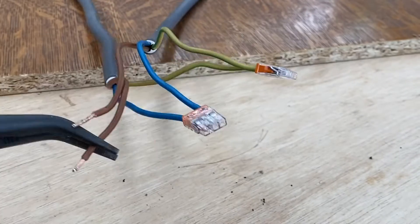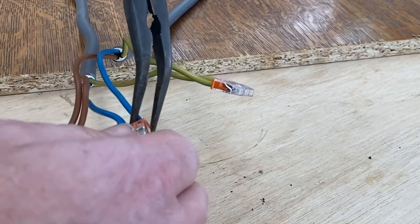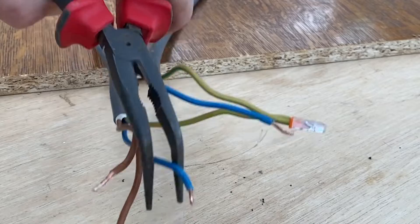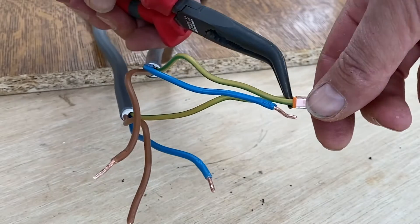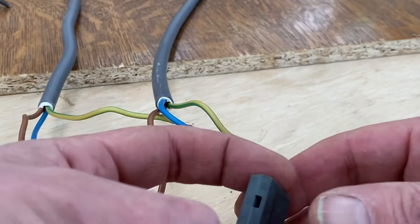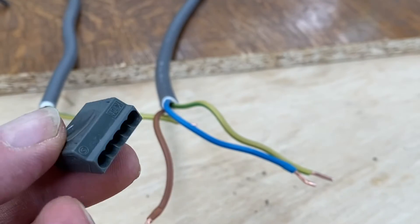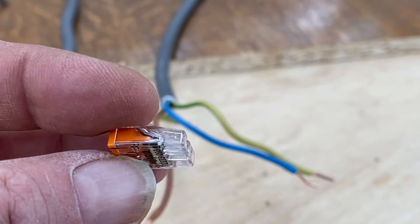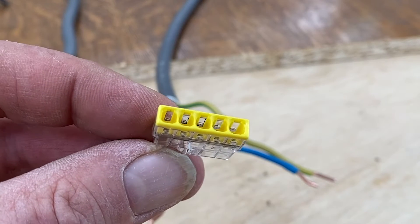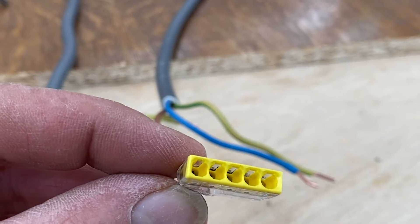So when you're inside plugs, it's really difficult to work with. These are really connectors you put in once and then forget. These connectors may also look like this — same principle — but the reservation is that you can't see what's happening inside, that's why I prefer the transparent ones. And sometimes you need a lot of connections, specifically when you have different switches on the same switchboard, so it can be very useful to take one with a bigger capacity of five wires.